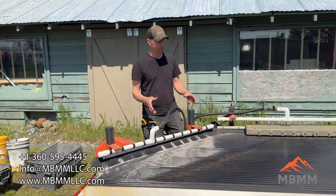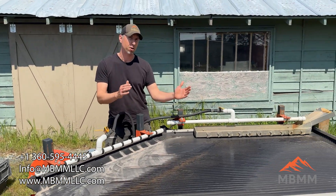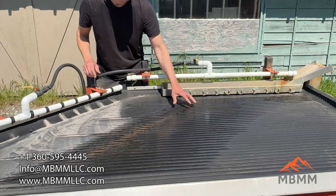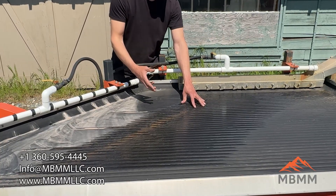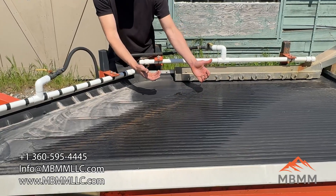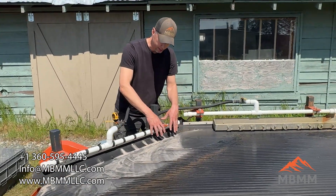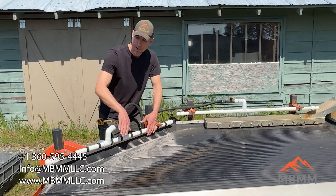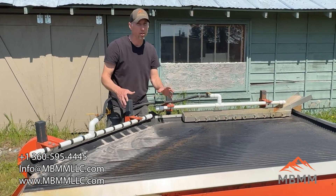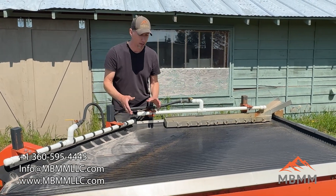The way this machine works is there are springs underneath the shaker table that bounce the heavy material across the black mat. The grooves in the shaker table top capture all of the valuable metals such as copper, tin, gold, and silver, and move everything valuable across the table under the water bar and down into the number one and number two concentrates. Our shaker table is different and unique from other shaker tables in a couple of ways.